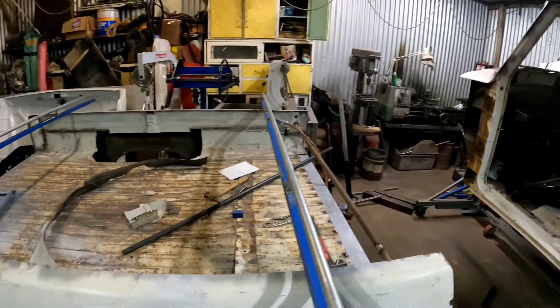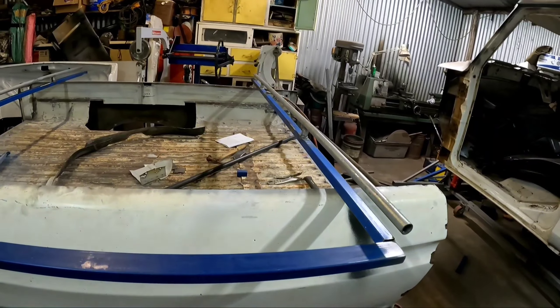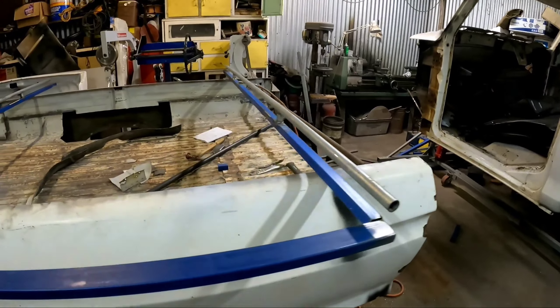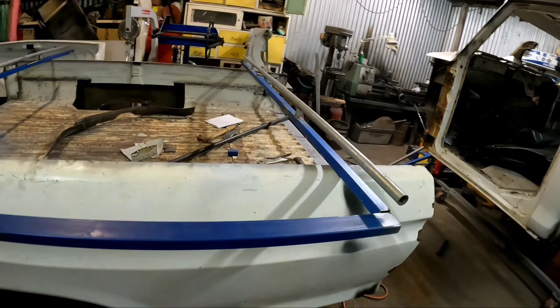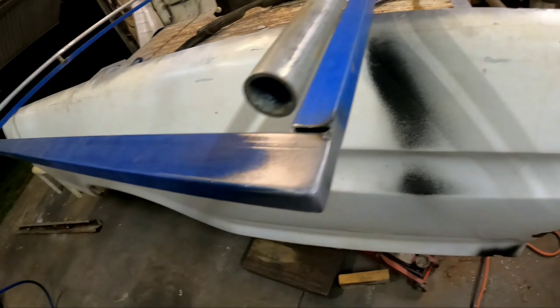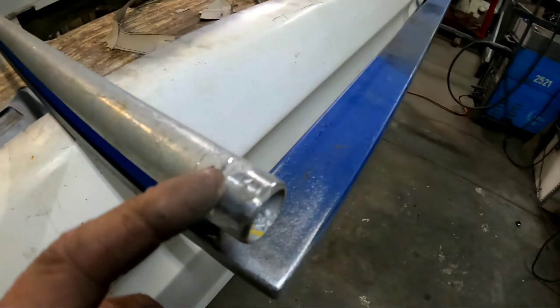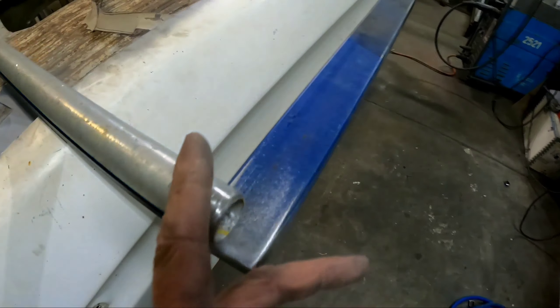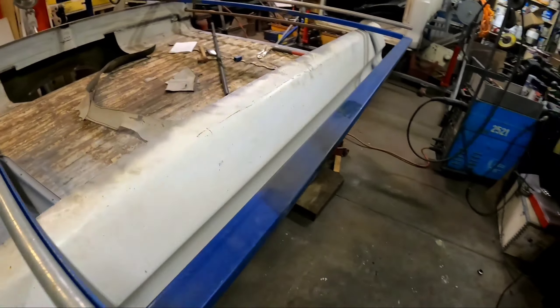So I've now welded it on the front of the sides, measured the ends, made sure they held the right distance apart, did a diagonal and made sure that was pretty square. The tub itself probably won't be square, but I should have enough room to sort of move it around and make sure it's going to work. All I did was just weld the outside, because once it's welded in I won't be able to get to it — the other three sides I should be able to. But with it like that I should be able to sort of pull it back or forth just to sit the tub and everything. I'm just going to set up the front rail now, probably 45 degrees of it, then run it along the front, put the uprights on as well, take it out, flip it over, put it back on the tub, and see how we're sitting.